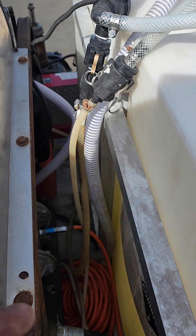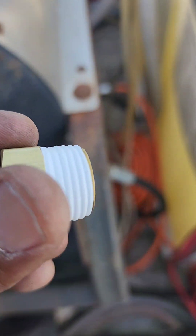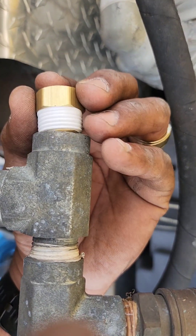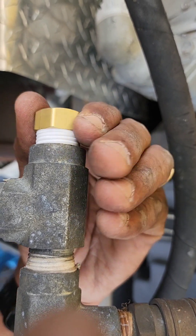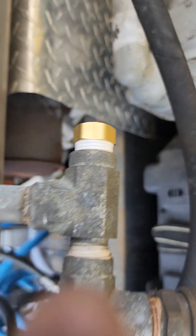I've taken the nut off and I'm getting ready to put the replacement nut on. This is the replacement nut — you want to thread this nut with Teflon tape and it goes right into this little port right here, this T-port. It's a size 7/8ths, so you want to put that in there.